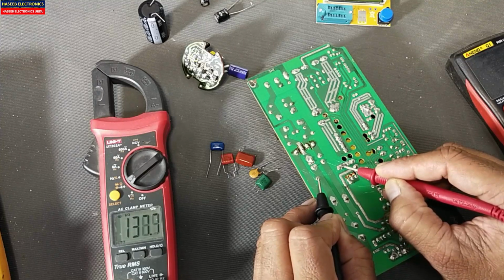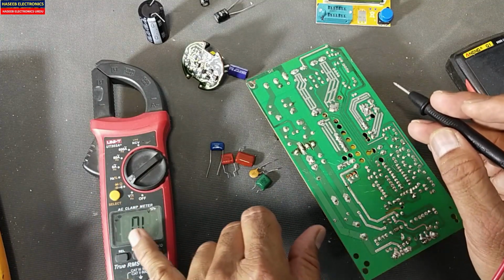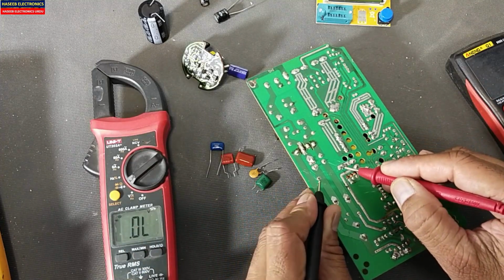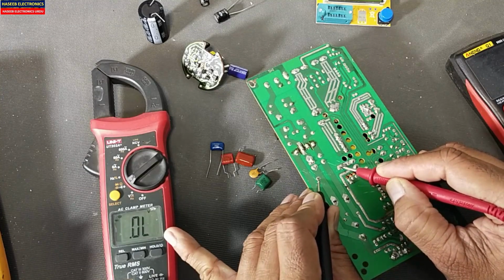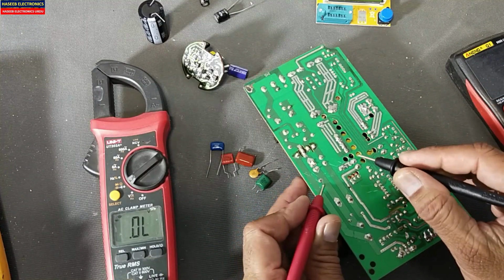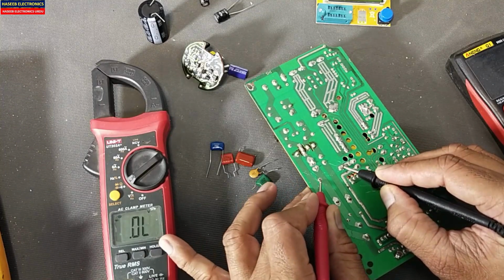So it is a good indication that the resistance is increasing, the capacitor is charging. Now let's move to the diode mode. It will start charging, it will show the voltage, and then it will say OL. That means this time the capacitor has maximum resistance. Reverse the leads. It will charge and it will say OL